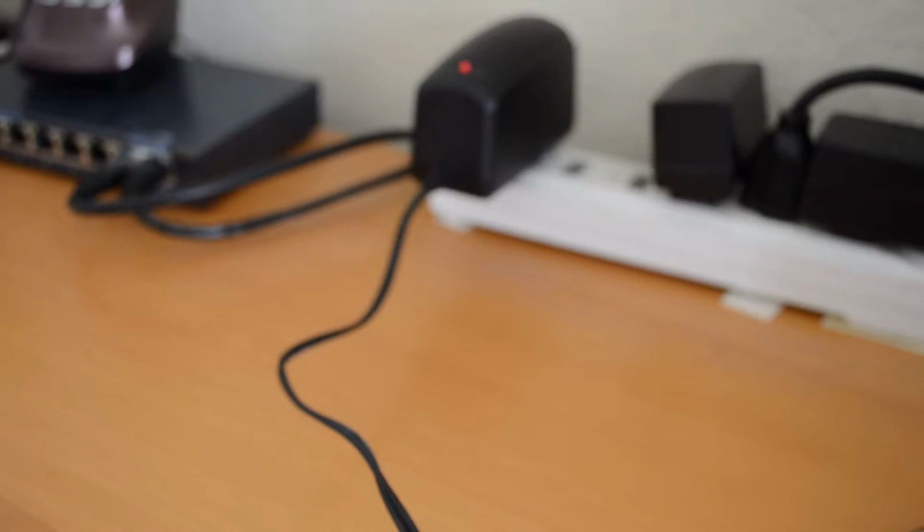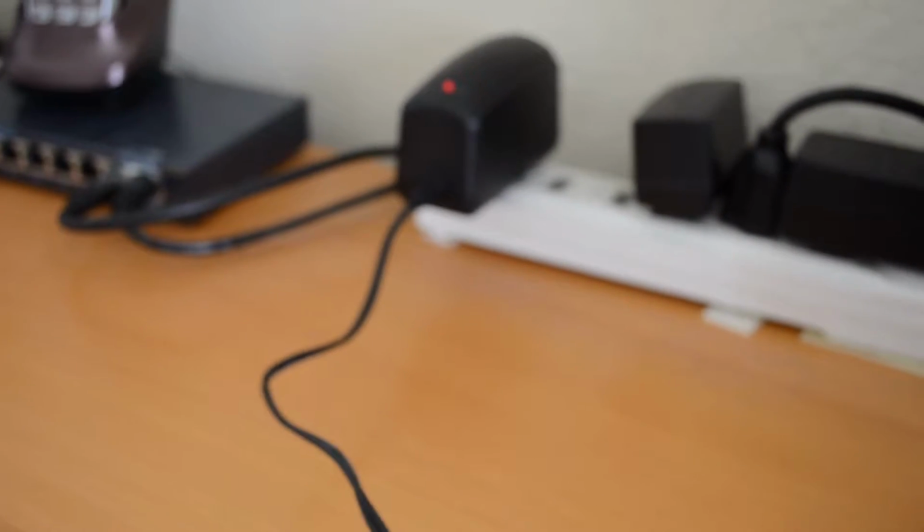And if I'm really quiet, I would hope to see a straight line. But as you can see, it's very sine wavy, and if I pause, it's pretty sine wavy. So I'm thinking it's my power supply, 5 volt 4 amp power supply. I'm going to play with some capacitors and maybe a different power supply and see if I can flatten out that curve, so when it's quiet I hopefully will get a nice straight line.